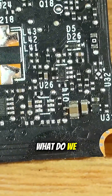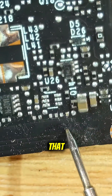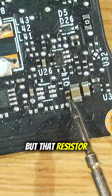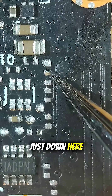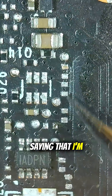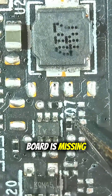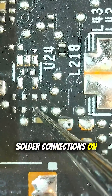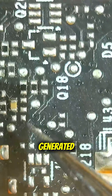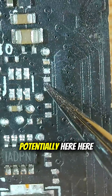What do we have here? I don't know how I've seen that, but that resistor is not on properly. It does look like that is also a ripped pad just down here. I'm now looking at these pads thinking, are they meant to have components on? It looks like a lot of this board is missing components, but I just don't know. A lot of printed circuit boards have solder connections on the board but no components populated. But it's pretty clear to see that this little resistor was meant to be there. I'm pretty sure there are meant to be components here, potentially here, here, here, here, and here.